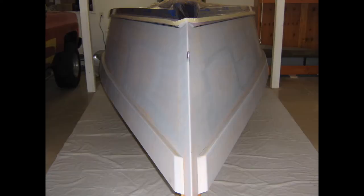Here is the boat after I rolled on the first coat of primer filler. I want to reiterate — I am not using the primer to promote adhesion of the paint. I am using it to fill in defects. It is perfectly acceptable to skip the primer phase entirely. I won't be using primer on the interior of the boat.